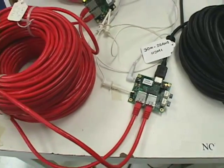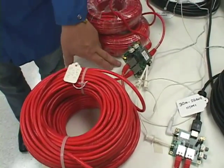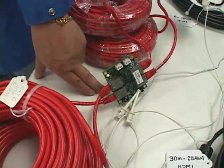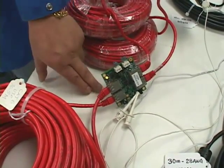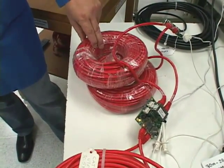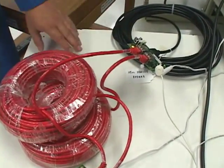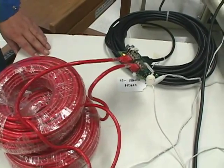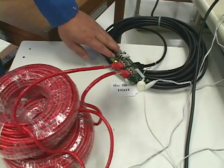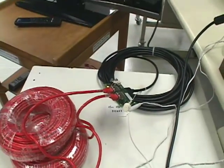This is a 30-meter CAT6 cable. This is an additional board — it's DS34RT5110 as a repeater. Then we go through another 30-meter CAT6 cable. This is the final stage of DS34RT5110 as a receiver board. From the receiver board, there's a 15-meter 28-gauge HDMI cable to the 1080p TV.